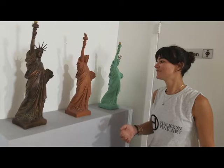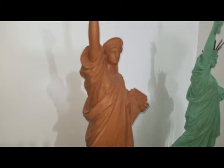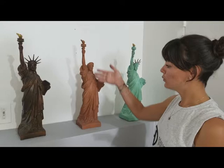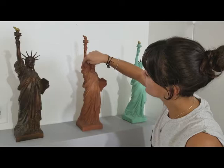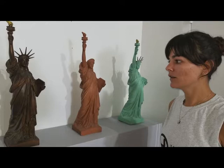Let's go back over to your Statue of Liberty, because this is really quite a story. This one is really like the one that Bartholdi gave to all the people who either gave money or helped fabricate the Statue of Liberty in New York. My great-grandfather, with that beautiful machine, participated in the enlargement of the Statue. So he gave us one in terracotta. From there, we made a mold — a silicone mold — and an edition. That was my first work in the studio. I made about 20 of those, working the seams every time in the draping, then put the weight under, finished and cleaned. The painting was the painter's job, but that was my first casting project in the studio.